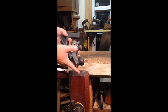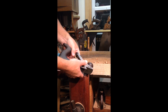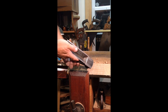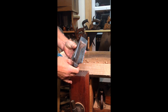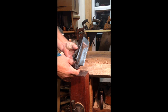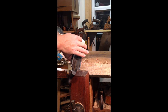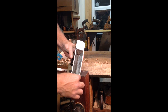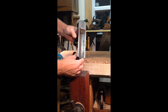The plane itself is pretty simple — it looks just about ugly. With an adjustment here, the nose, the nosing section slides up and down. This being a slight chamfer, this being more substantial, and that being just about the whole thing gets lopped off. So you can see the piece of stock travels from the nosing section, which will take off the corner, until the remainder of the stock runs along the outside edges of this triangular area, this 45 area.